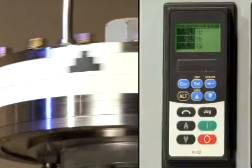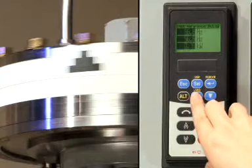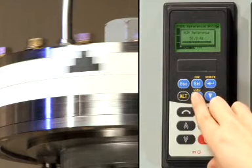Be sure to tune the vibration in to 3/4 inch amplitude. Look at the vibration amplitude chart on the side of the VSEP to monitor the vibration amplitude, comparing it to the stencil on the front of the filter pack. Once you've reached 3/4 inch amplitude, you can go to the higher pressure in order to check leaks.